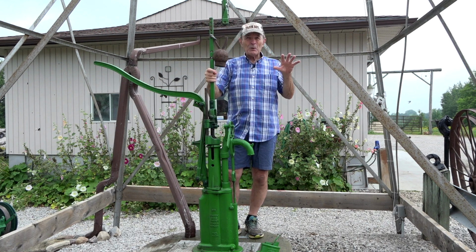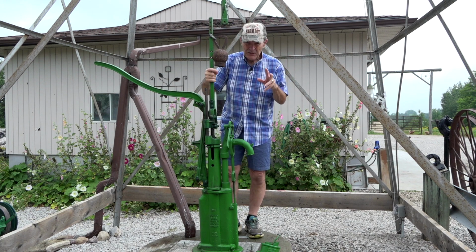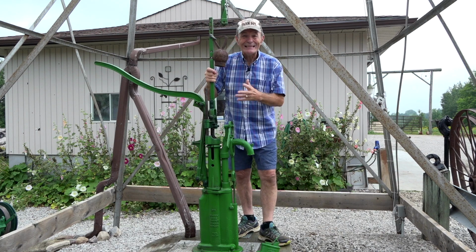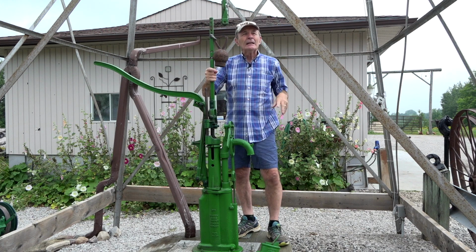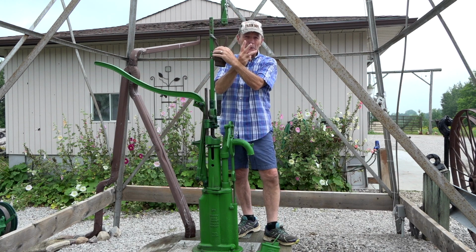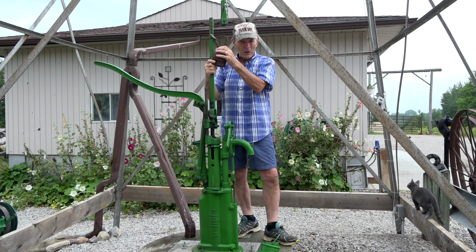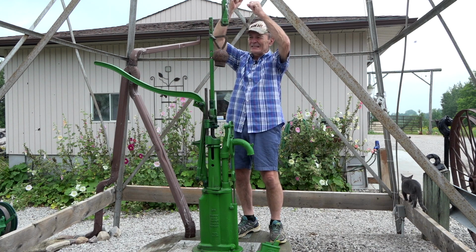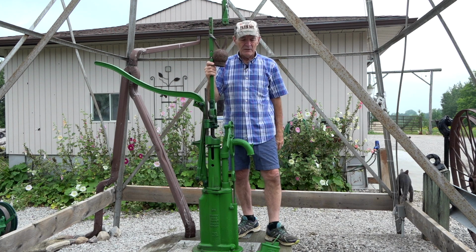Many windmills were anywhere from 20, 35, maybe 40 feet, which was considered a fairly tall windmill. In those days they had taller ones, but 40 feet was pretty tall. This is 52 feet. Yeah, it's 50 feet. I wanted a nice big tall one so all the neighbors on a hill could see it. Anyway, it's quite long, so that means the rod is very long. I usually need at least 3 pieces of rod. The rod is typically an ordinary 2x2 piece of lumber. But the problem is, even if it was sealed, it would start to warp and bend, and with the windmill going up and down, it would break at the joint. It's been an ongoing issue with me.